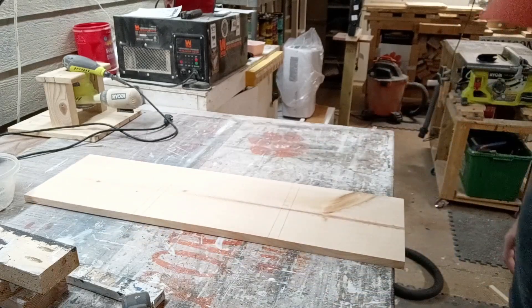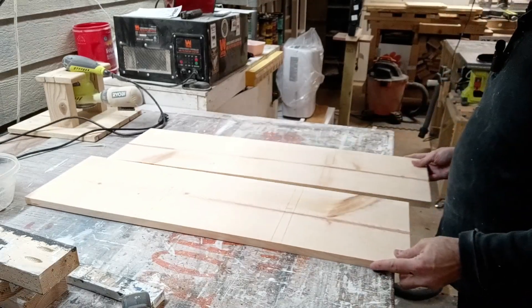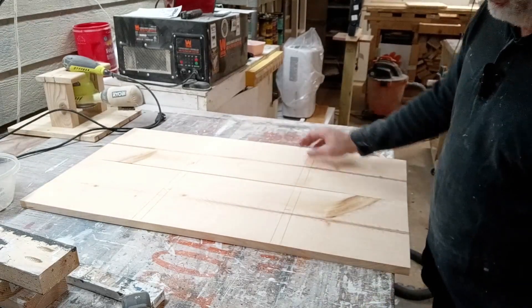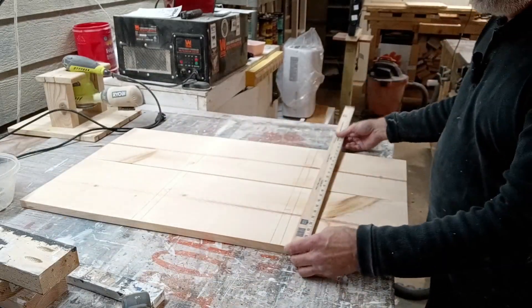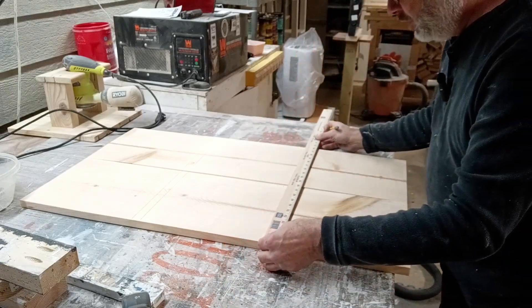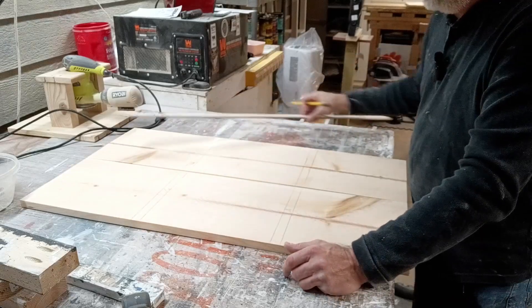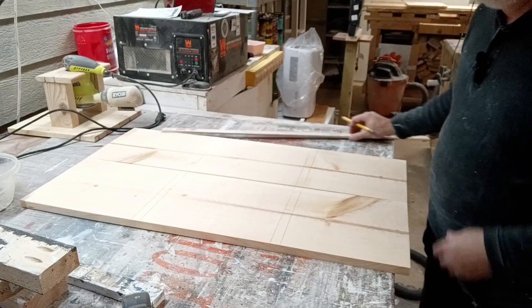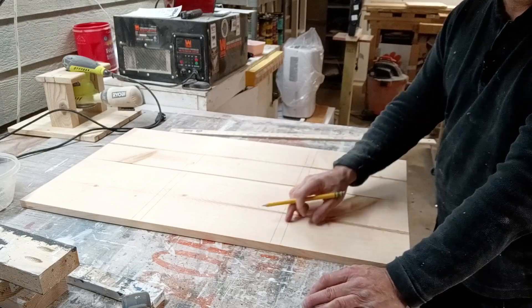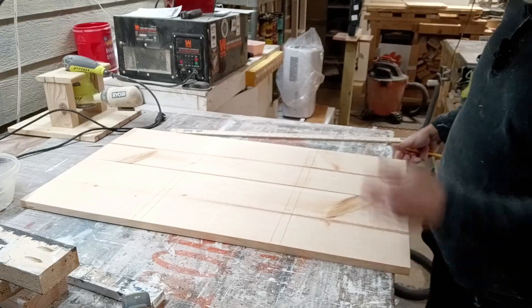The way I like to do the shelves to make sure they line up right is I'll butt the two boards together — these are the two sides — and I went two feet in each section for the shelves. I get my ruler and line it up and go all the way across, scoring the line all the way across. The reason is it gets it level all the way across. You don't have to measure from here to here and mark it, then measure here to here. You just lay them side by side, mark it all the way across, and it gets even that way.